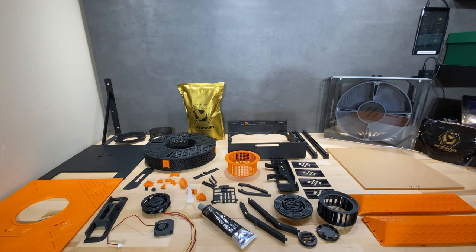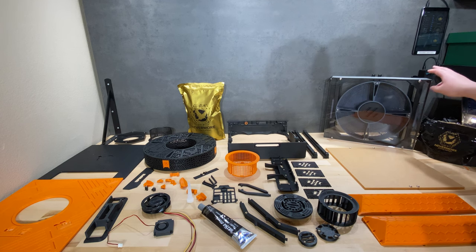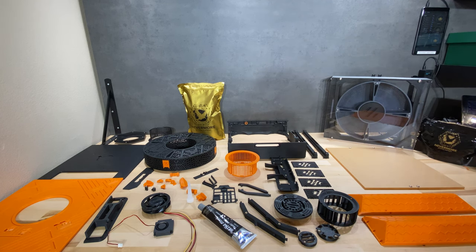Welcome to the next episode of the Voron 2 series. In this video we'll be working on the Nevermore Max 2 air filter for my Voron 2.4. You might have seen the previous Nevermore Max build on the channel before, way back before I moved here — that was about three years ago. This is a successor to that and comes with a bunch of improvements. You can print it on a 300mm bed, it has air quality monitoring with SGP30s or 40s and BME280s, and it has quality of life improvements. It also looks nicer and doesn't need as much acrylic.